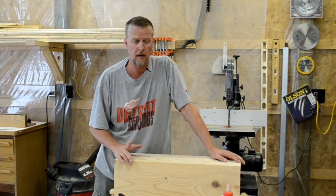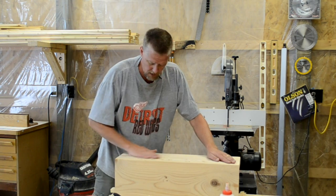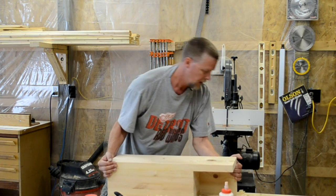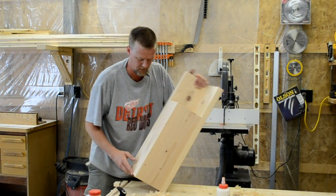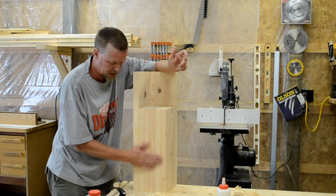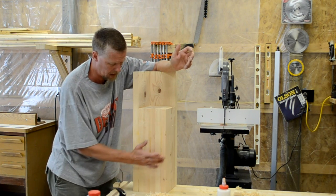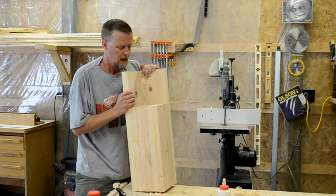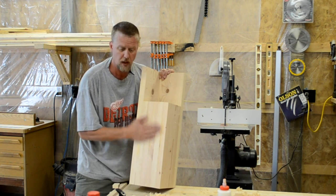While I'm waiting for the glue to dry on my veneer, I thought I'd spend some time cleaning up the legs. I'm just using a standard hand plane, tightening up and cleaning up my joints. There's nothing like working with a hand plane that really makes you feel good about your work. Originally I was just going to leave the lamination visible since it would be underneath the table, but because I'm so happy with how the laminations came out for the frame pieces, I decided to go ahead and put a layer of pine over this as well.